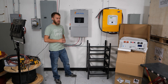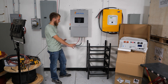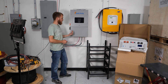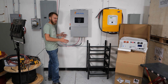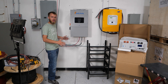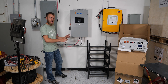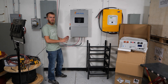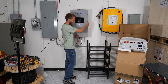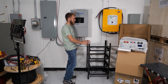Let's talk about placement. I would not want to put this rack right under this Solark 5K that we're connecting it to, because for code compliance you need to have a 30-inch wide space — and I think it's also like 30 or 36 inches deep — around this Solark to have a proper working space. If the rack was directly under the Solark, it would impede on the safe working space. So I lined up the right edge of my Solark to the left edge of the rack, and that's where we're going to install this.